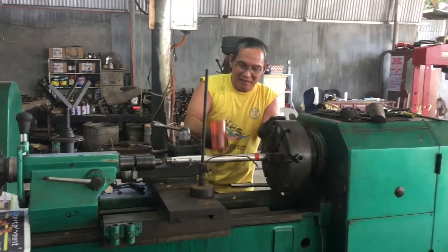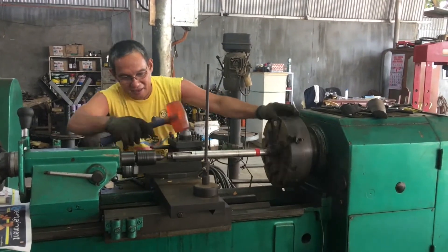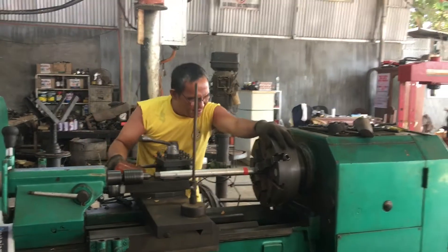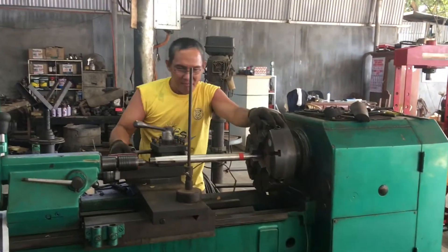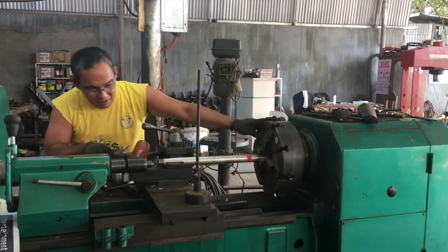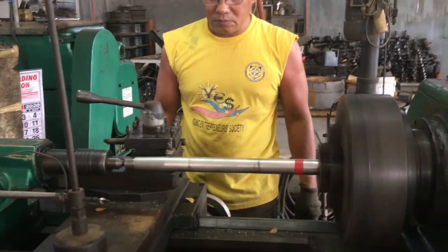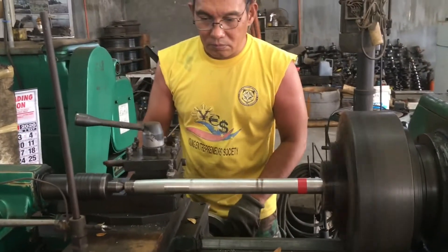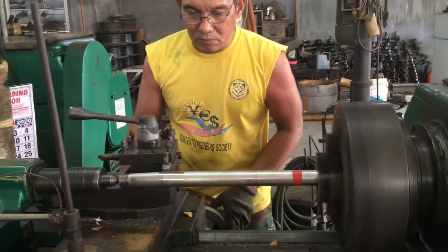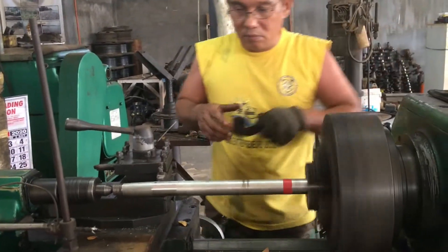Alan's having to make a few adjustments because it's a four-jaw chuck. If it was a straight three-jaw chuck, it would more or less be pretty square. This is why I don't like using four-jaw chucks. What Alan's going to do here is skim maybe just a couple of inches along the shaft, and we'll check the stator ring for size before he continues the full length.